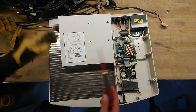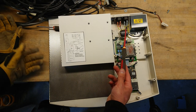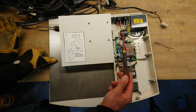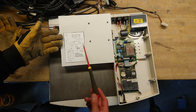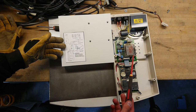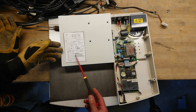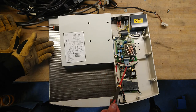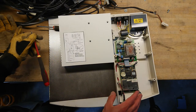I guessed correctly about this white plate — it's some kind of reader or ID transmitter for the image plates, along with passing 230-volt AC to the monitor probably sitting on top of this unit. It has a small internal power supply, a data connection, a serial connection going through a ferrite, and the 230-volt AC through a ferrite as well. The schematic shows power in, power out, an RS-232 serial line going to the power supply unit, and then connectors out to an LED, reset push button, and the antenna PCB. It says: 'Check connection — wrong connection destroys antenna PCB.' Not quite sure how you'd accidentally reverse that little cable, but I'm sure some service technician has done exactly that.